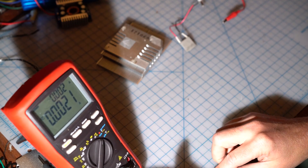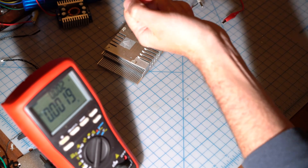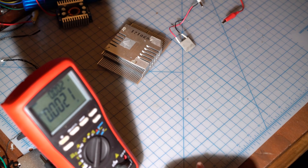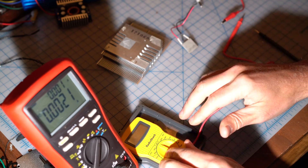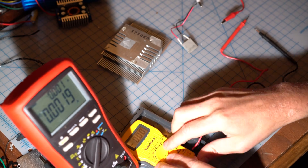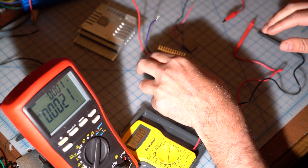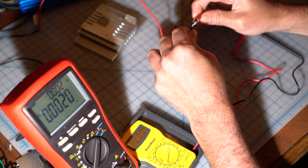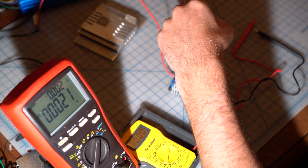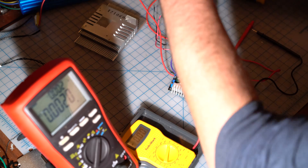You should really never leave the multimeter on the amp side like that, because you might go and try to check the voltage of something and you'll short it. So you should always revert back. I'm going to pull over a little voltmeter for DC 20 volts. I've got a little step down here plugged into a 15 volt battery. So I can also show you these step downs too.